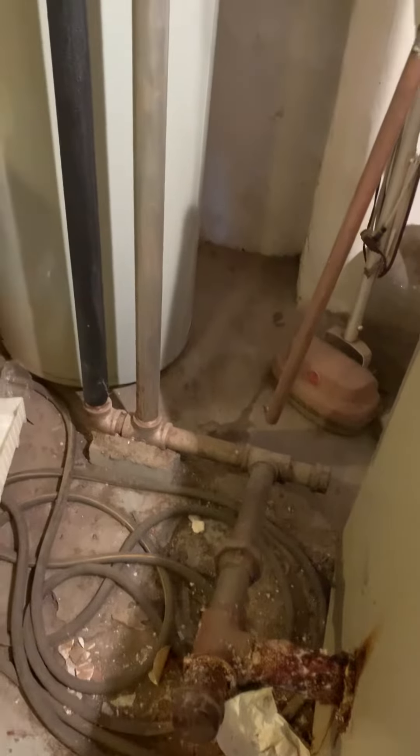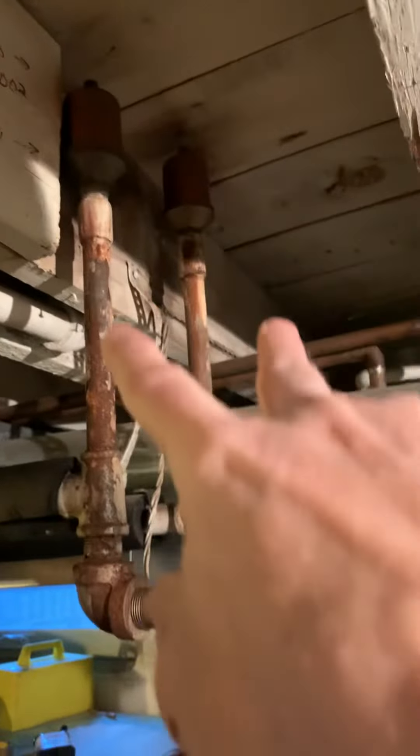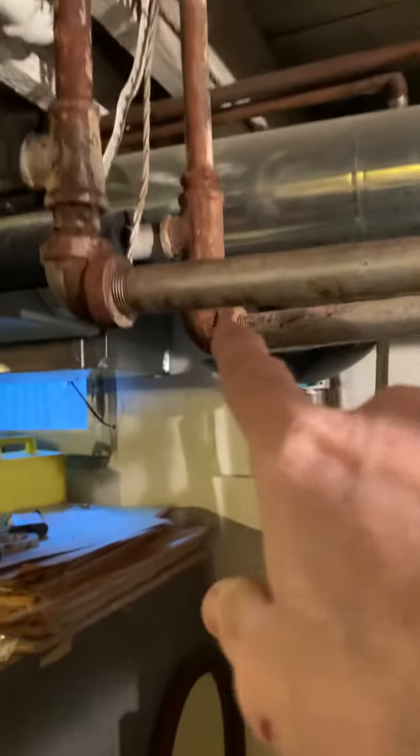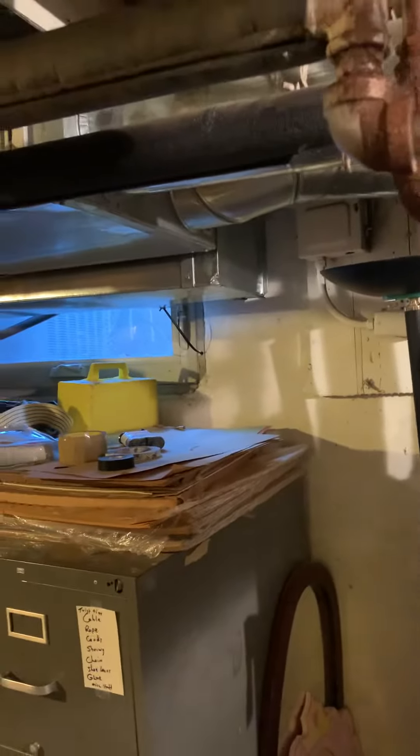This is our issue right here — this is where we're leaking out. That looks to be inch and a half. We've got two unions here, and another thing that's looking pretty bad is this line behind here. We've got a 90 right there, so we could cut and put a new piece in and reroute all this back. This one comes across about 20 feet of line, so that's where we'll probably be replacing.